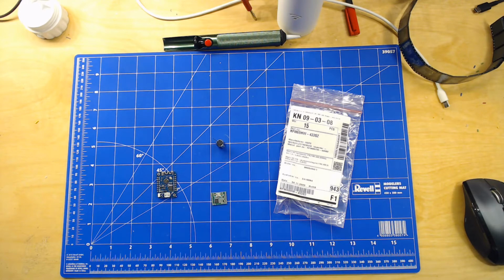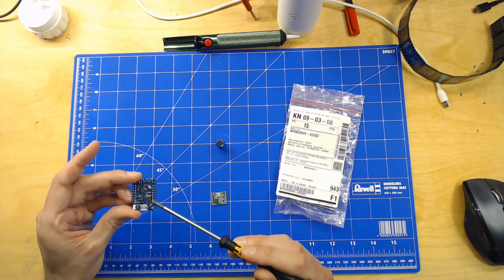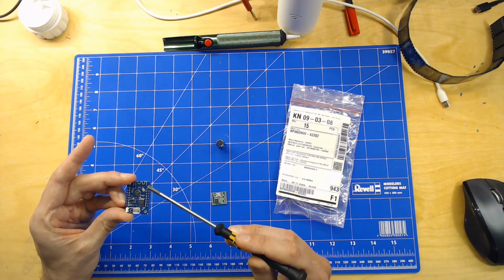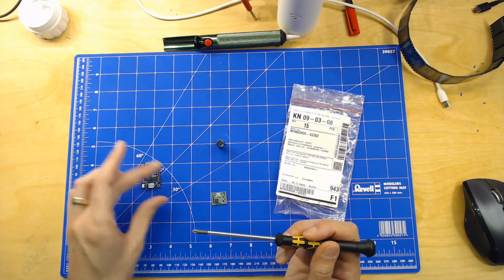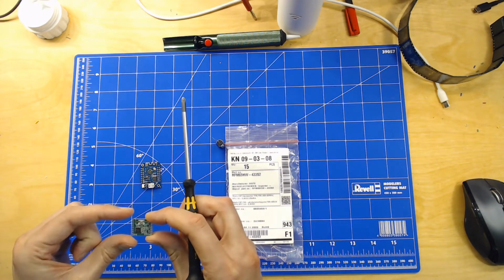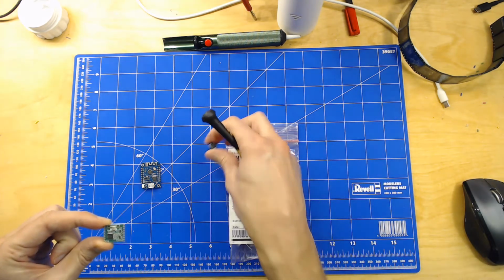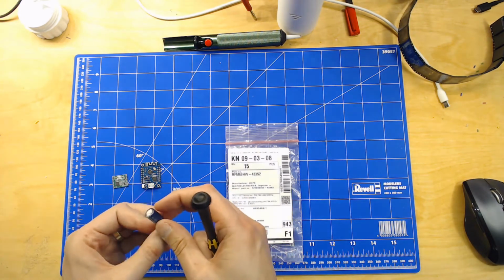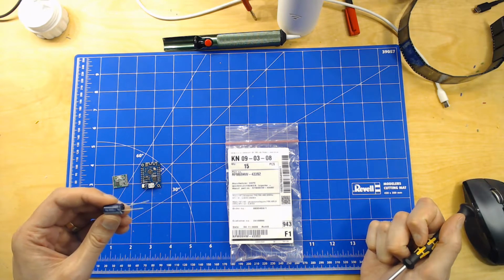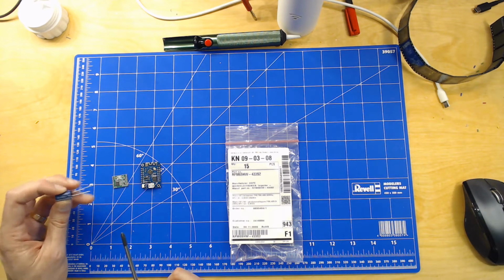These are the components that we need for our MQTT gateway. I'm going to use the WeMos D1 Mini. It's an excellent chip, really reliable and good Wi-Fi on board. And then we're going to hook it up to our RFM69, which is then the high power version of this 433 MHz chip. I also need to add a decoupling capacitor. You don't need this big. This is 1000 microfarads, but it's enough with 47 microfarads or something like that. But you need a good and stable power for the RFM69.